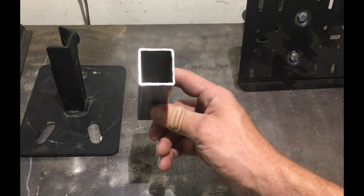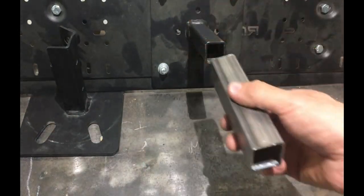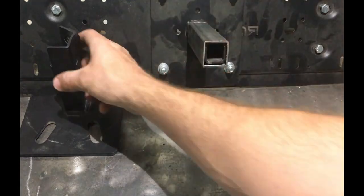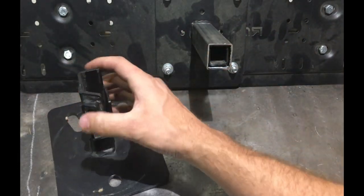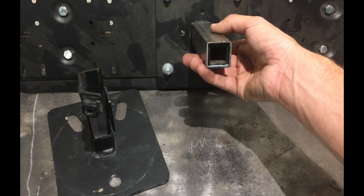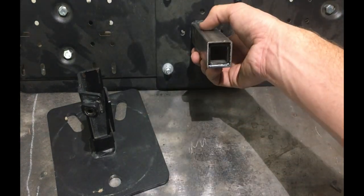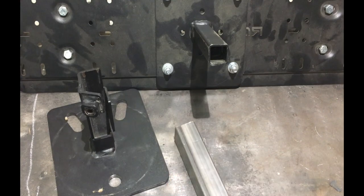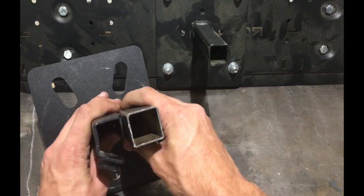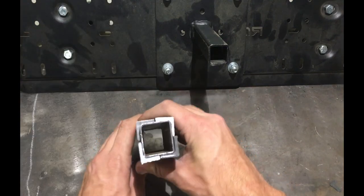This is 1/16-inch square stock — I think it's two inch — and it slips over with a little bit of slop, but that's okay. We can put a set screw here and a set screw here, and then we can take the slop out with just the set screws while the square tubing still takes the weight. Now, some of you may be thinking 1/16 inch isn't anywhere near as thick as this — and you'd be correct — however, this is fully boxed and the original clearly is not. So now we have a nice beefy part.